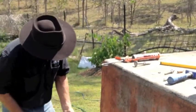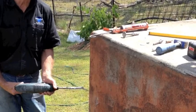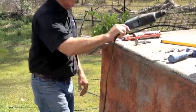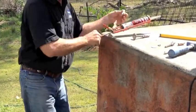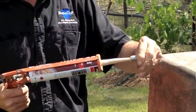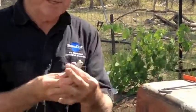First you drill a 16mm by 50mm deep hole in the masonry substrate. You then get the drop-in anchor and fill the end of the drop-in anchor with a construction type glue.